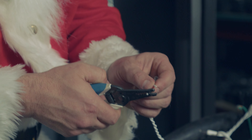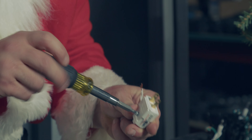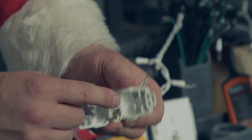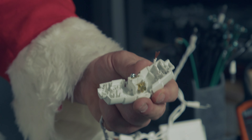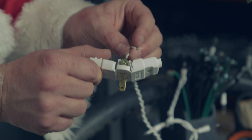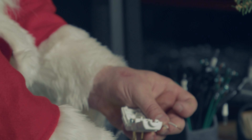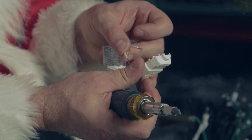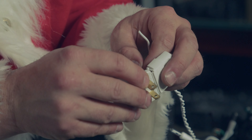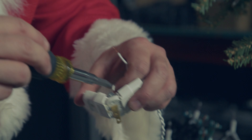You strip a little bit back and a little bit more back on both wires, then take your cord end. You're going to loosen it up so it opens up. There is a gold screw and a silver screw. On previous Empowered videos, they talked about how the gold is for the hot and the silver is for the neutral. Since it's a two-wire cord it doesn't matter as much, but you want to get enough conductor and slide it in.